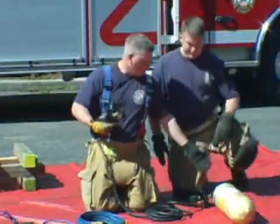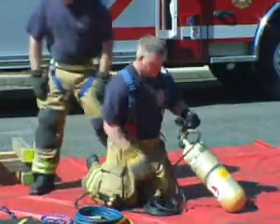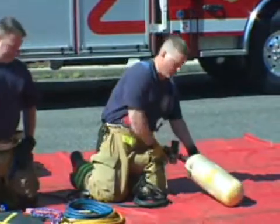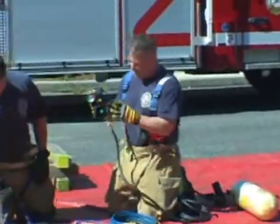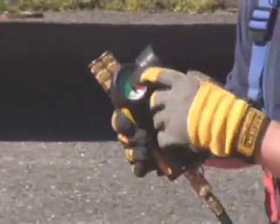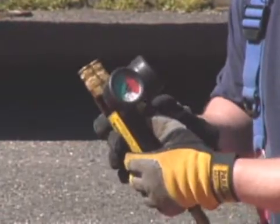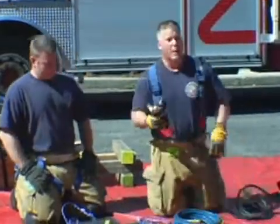At this point, we would turn the inline valve on the regulator itself to the open position. This supplies the controller with air. A simple test to ensure that we have air would be to depress both the activation buttons. When we do that, we see the gauge dial up, and we can relieve the air by pressing the down button.